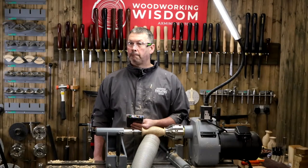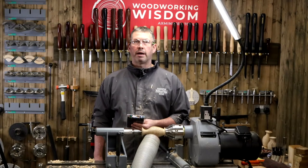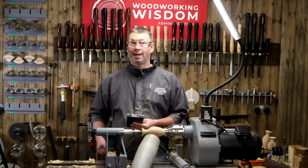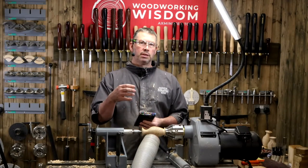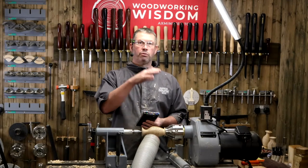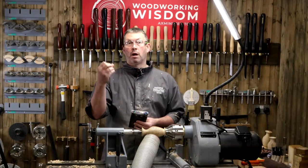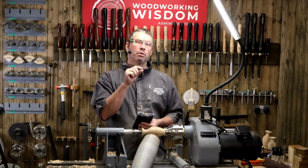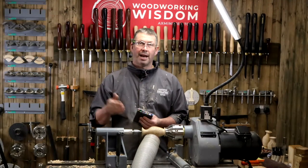Yeah. In terms of depth, we're talking about 2 to 3 mil in the depth of both the wood plate and the nylon. But the nylon, don't forget, that was drilled instead of turned. So that was on a pillar drill and step drilled. So three different drill bits, starting with a large one, middle size, then small, at about 2 to 3 mil per drill bit.